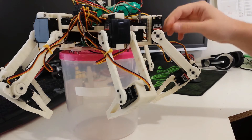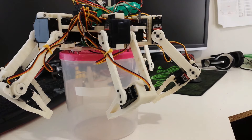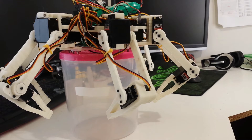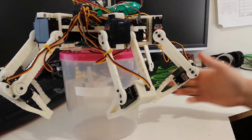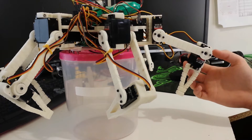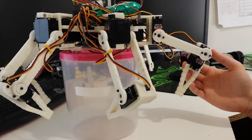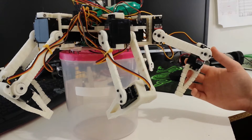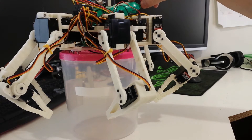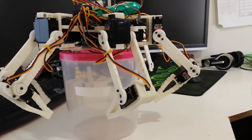Under full load these servos pull about 500mA at 6V, but they're never really at full load, especially the coxa joint. After a great deal of empirical testing of each individual leg — applying a manual load greater than I'd expect under normal operating conditions — I found that each leg draws a maximum of about an amp each. That's 6 amps total plus about an amp for electronics. It's all powered by a 2300mAh 30C nickel metal hydride battery, which provides plenty of power and gives about 15–20 minutes of run time. I don't have any battery level monitoring yet but that is planned for the future.